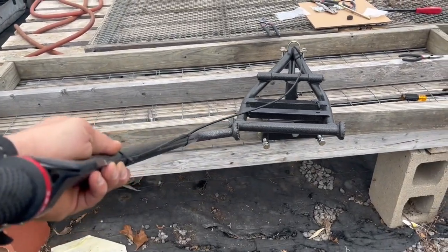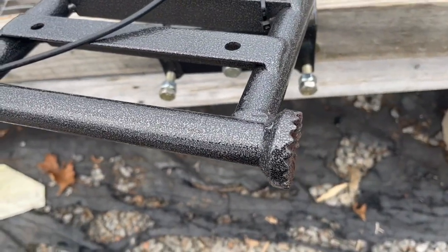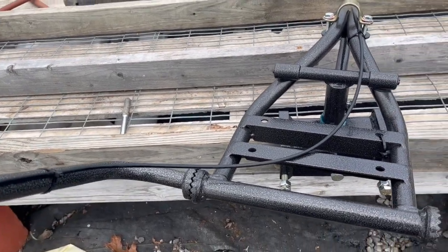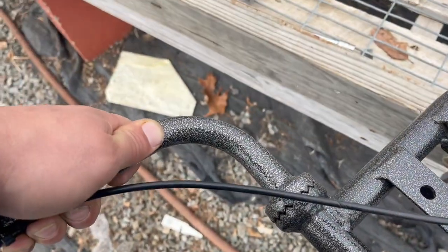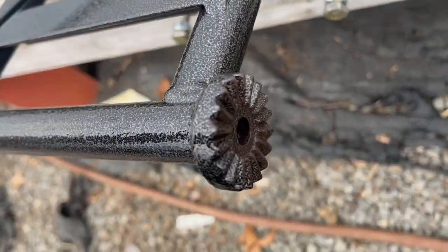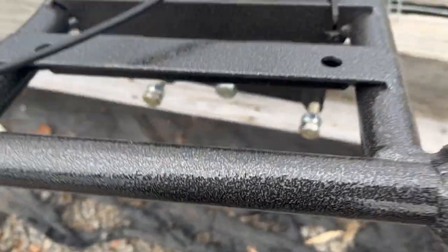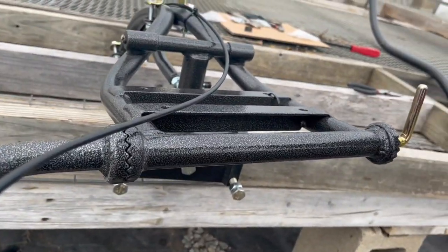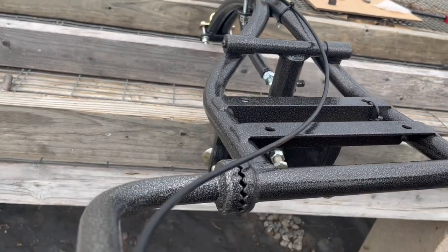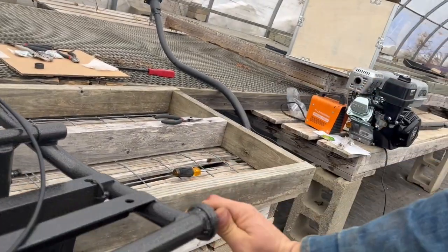I've rotated the assembly around to check where I like the throttle handle. It's got a zigzag cross section so it's very adjustable - you run a long bolt through the other side. You want to see in your boat how high or low you want it based on where you'll be standing or sitting. Once you have the height you like, thread the long bolt in on the side. You can slightly loosen it and adjust it easily on the fly without tools, moving to the next click and tightening back up.